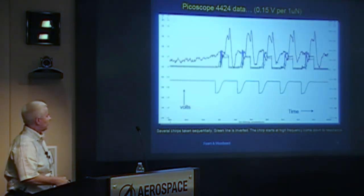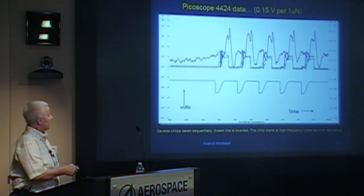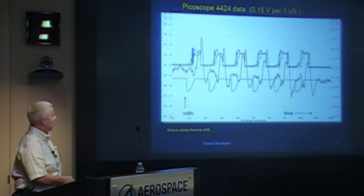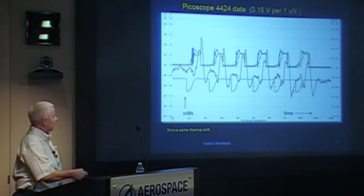Here's a few more of the chirps. So you see a whole section. Here you see where the voltage hits the resonance, we get a bump, and then we get another bump as we switch off. And similarly again, you get a bump and a bump, and here's a whole row of them. They look rather pretty, so I just showed a few there. And I've got a few more runs. Here's one where you see a bit of thermal drift. There's a bit of a drift in that, but